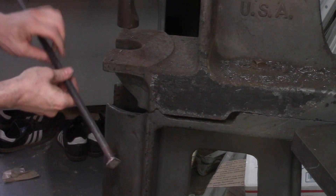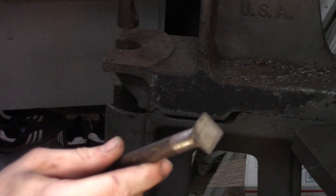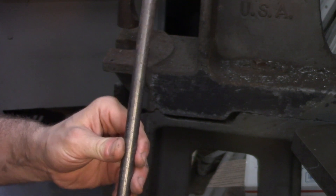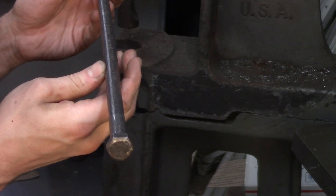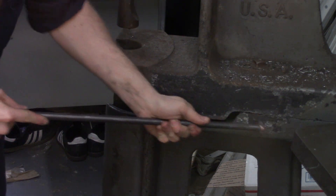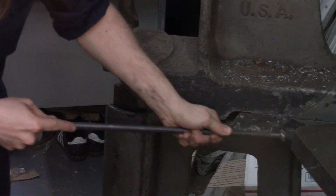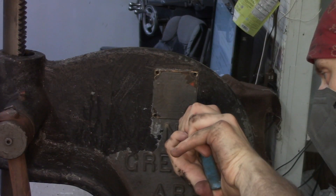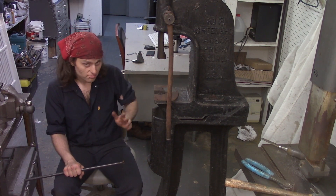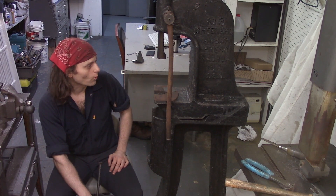If you watch Dee Dee's channel you'll recognize this kind of thing. Mine is way uglier than any of the ones he's made, but it's a carbide insert that's just brazed onto a steel rod — a long hex head bolt that came out of some kind of old fabric cutting table or something like that. Once it gets under that layer of paint, the paint just really flies off. It took me all day, but scraping the paint is basically all done. I'll go over it with a wire brush on an angle grinder now.